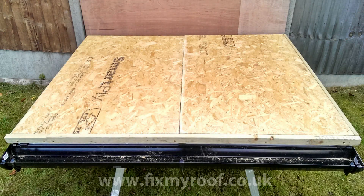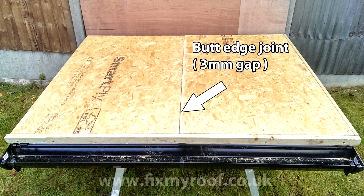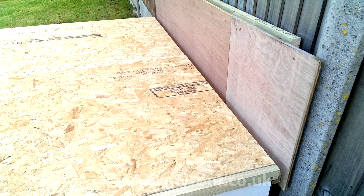Anyway, enough of Photoshop. Let's have a quick look at a small roof mock-up that I've constructed at floor level and I'm going to show you in photos and video every stage through until final completion. I've constructed the roof deck using standard square edge OSB 3 rather than the tongue and groove profile, and that's just because it's a very small roof and I can show you how to tape and bandage any butt edge joint should you have one if you're using 8x4's.